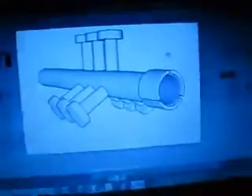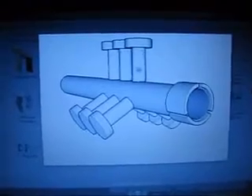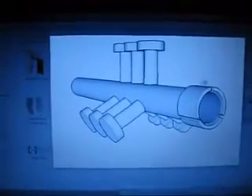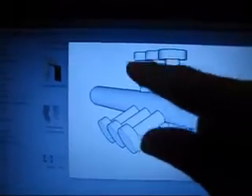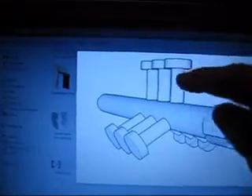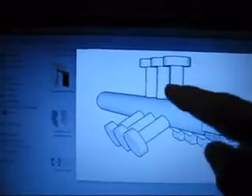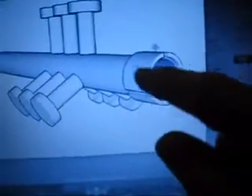So here we've got a Google SketchUp render view. Basically you can see where the coils will be. I just used three banks — one, two, three — three banks of three bolts each, aligned at 120 degrees in between each bank.